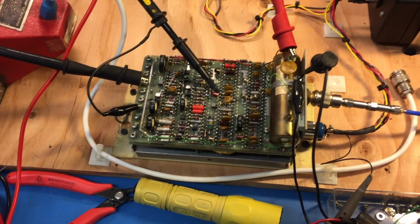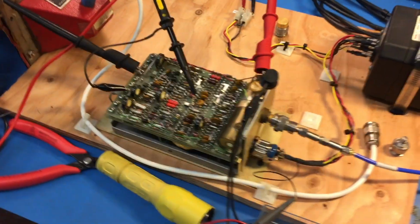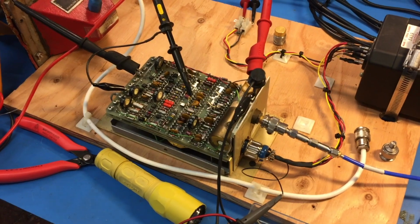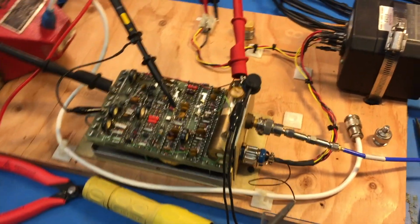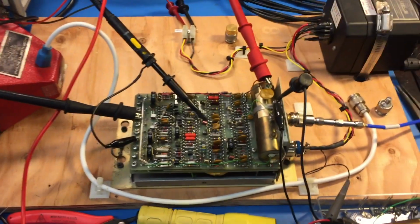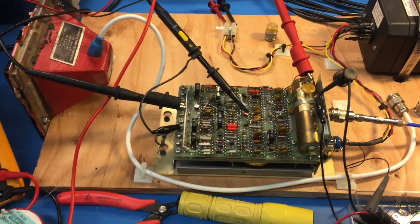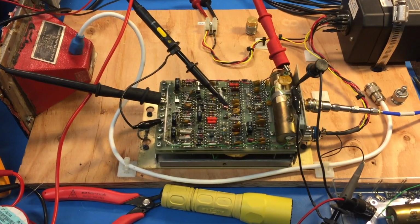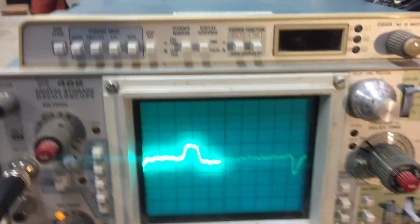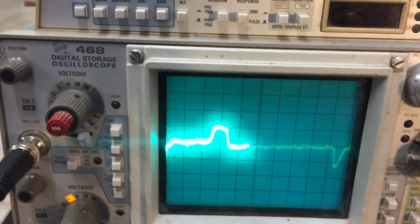It's sensitive. The problem with me testing it in my lab is that I'm just picking up too much clutter, and so it sees nonsensical readings. Therefore, the best way to test it is like this, in a conductive test, unless we're flying it in an aircraft, which we don't have. The ground return is pretty bright and it's very distinct when you're in the air. There's no other clutter to confuse you. And when you're measuring time of flight, like we are here, clutter will be a huge, huge problem.